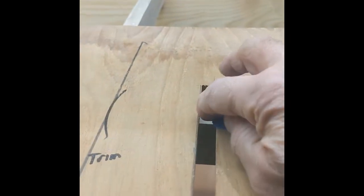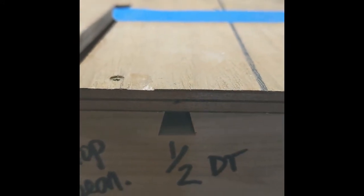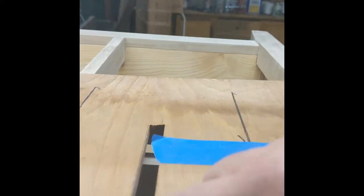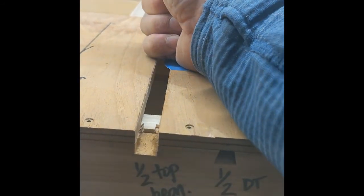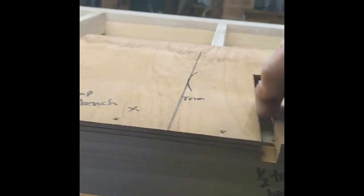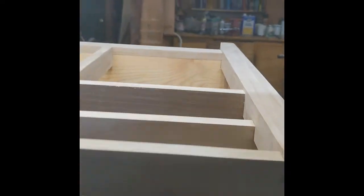The work piece slides in here. I use the jig for two things: just to make dados, which I've done in the legs here, and also - repositioning the top and lining it up with this dovetailed slot - to make sliding dovetails. It works great as long as you get this slot very tight. You just clamp the workpiece in there, put your router in, plunge it and slide it back. This front piece stops tear-out, so make sure you do that or you'll have tear-out from these dovetail joints. There are 10 of those sliding dovetails here if you count them.